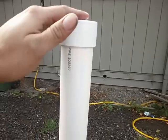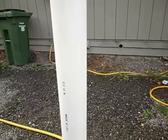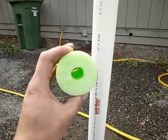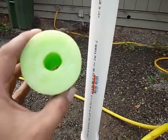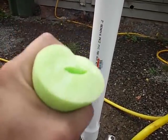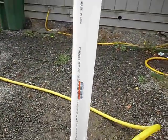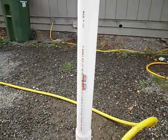This is a two-inch by 30-inch piece of PVC with a cap glued on the top, and 15 inches — basically half the distance — is filled with closed-cell foam, more commonly known as a water weenie. What this acts like is a bladder of closed-cell foam, so every time this thing pumps it'll compress and rebound, compress and rebound. This is the simplest way I found to build them; other people use bicycle inner tubes and things like that.